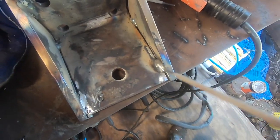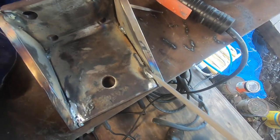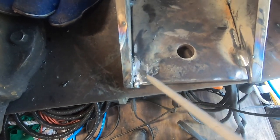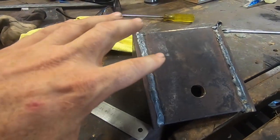Something I'm getting my head around now that's helping a lot is just grinding away your tacks or your root passes before you do your caps. It's like there's a bit of a stigma about welding and then grinding - the classic 'grinder and paint make the welder I ain't.' I was kind of shy of the grinder, but the grinder is a really important tool for a welder, particularly grinding the first pass before you put the second one on. No need to grind your final pass, but it certainly helps getting those tacks down and getting a smooth bead right over the top.